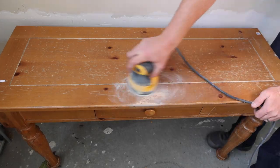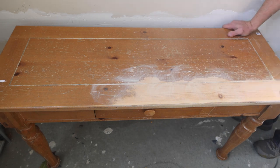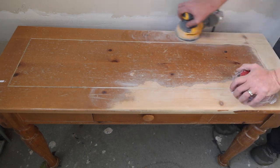the bottom. When I'm sanding a tabletop or top of a dresser or something, this looks like it's solid wood. So I'm just gonna sand it. I'm starting out with an 80 grit and then I'll work my way up through the grits there. I'll probably end at 220.